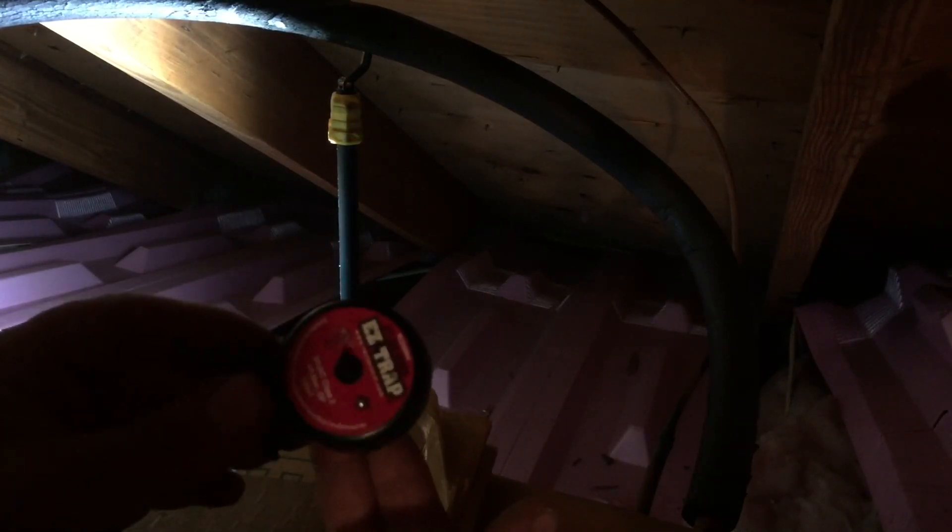Because it was wedged open. So if water backs up in that trap, the water will fill up, hit the float switch — similar to a toilet bowl — and shut it down. So now that I flushed the trap, we're going to place it back in, and then it should kind of say perfect.